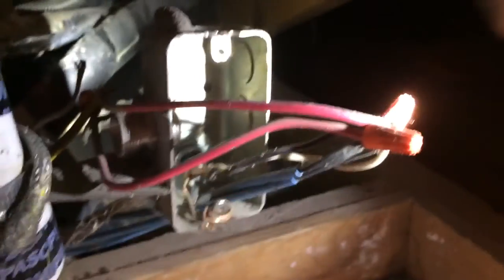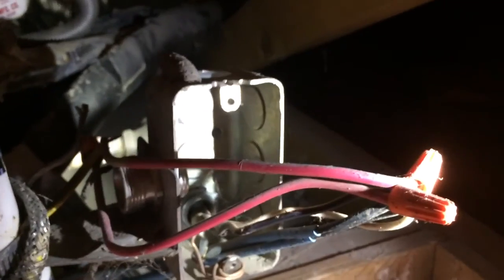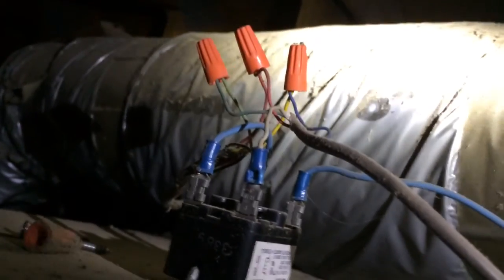All this electrical, I mean, there's electrical everywhere that's just spliced. All this crap. So undo all the splicing. Let me hop up a little further. You can see some of the electrical here. This is the thermostat wire. We should pull a new thermostat wire just because this one's spliced in about 3 spots. Here's a little relay where they spliced it. We'll pull that out of there.